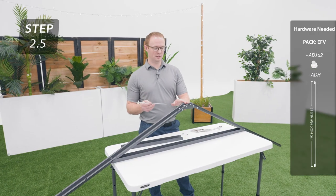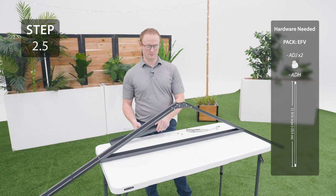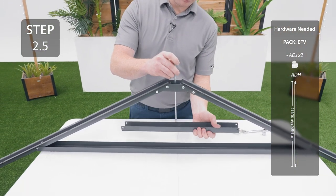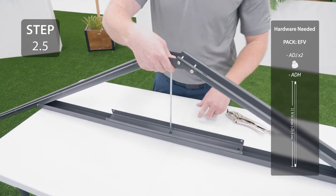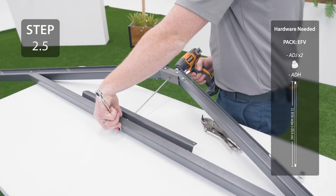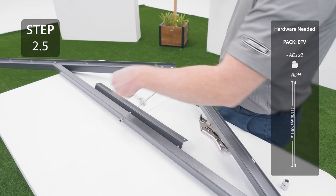Insert a truss rod through the connector, adding a short truss brace, and then going through the large truss brace. Only tighten the hardware so that this rod doesn't wiggle. Repeat this section 6 more times for a total of 7 truss assemblies.